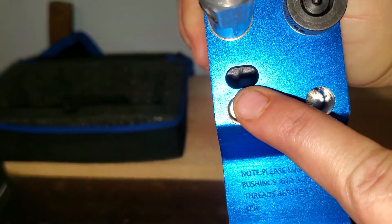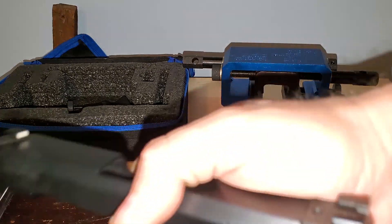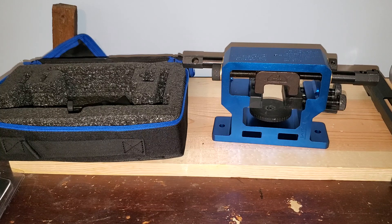The other thing that's kind of neat is it has these holes - here for the rear sight and here for the front sight - and those let you see that your jaw is lining up on the sight and not on the slide. You can get in there with a flashlight and really make sure you're lined up before you start cranking away. If I was a full-time gunsmith I would bolt this to my workbench close to my vice as my go-to for every sight, but I'd also realize it may not work on every sight and I might still need a hammer and brass punch.